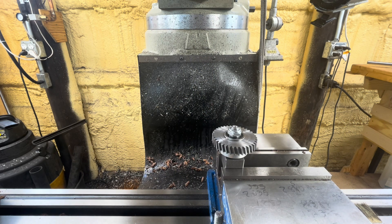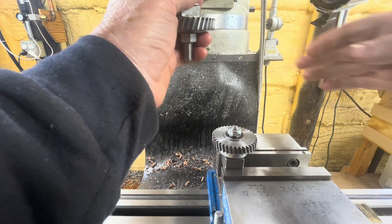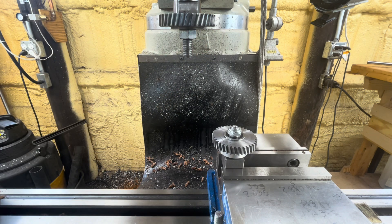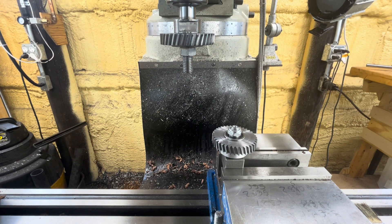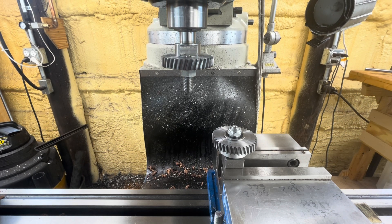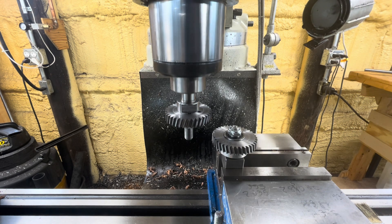In this case I just had a solid arbor that was the right diameter for my gear, just by chance. You put that in the machine and then put the gears in mesh, and then — what you'll hear when I stop talking — is me starting the machine and then advancing the gear on the right into the mesh to tighten it up.